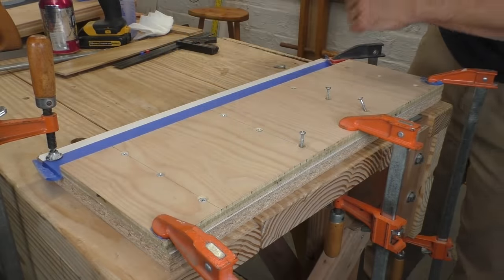Because we want the finished board to be easy to grab, I'm going to drill a nice big hole in this lower corner and cut a smooth radius with my turning saw. The final board is a bit more high-tech looking than I'd planned, but all the features make it easier to use and more durable. Take a day to make this thing, and you'll have it for years. My shooting board is conveniently stored right under my bench and sets up in seconds. When the board I'm shooting is especially long, I set up the support block, and now my stock is held flat and steady so I can get on with trimming it. I've been using a support block with my old shooting board for over a year, and I find the space in between makes a great place to set a couple of edge tools — it's like having a little tool well, and you can lay boards right across without bothering your tools.